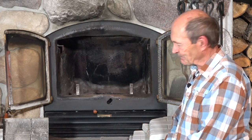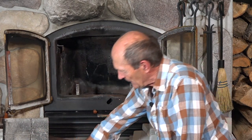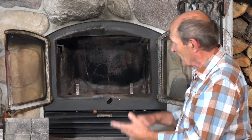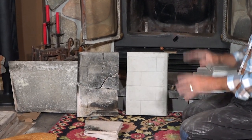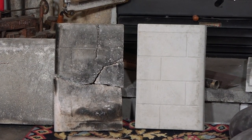To line this particular stove and replace all the stones would take about 24 fire bricks — still a big savings, looking at a couple hundred dollars — but then I'd have to cut them all and fit them all. That large stone in there would be about four fire bricks. So after thinking about it I decided: I'll just buy a replacement kit of refractory stones from RSF. One of the nicest things is they're cut to the right shape — you can see this new one is cut to the exact shape, so it just goes right in.